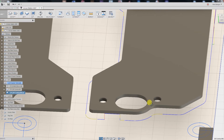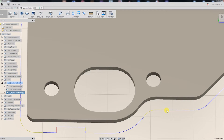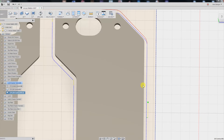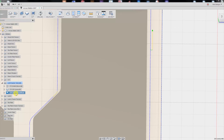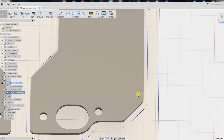This is the toolpath that's been generated. We see that when we have the reduced feed rate distance set to two, that means the tool will start slowing down two millimeters before it approaches the radius. But we can see that we're actually missing a few radii — this corner, this corner. So if you find that happens, you have to go back into the operation and increase your reduced feed radius. Let's increase this to seven millimeters. Now we're starting to catch all of these corners.